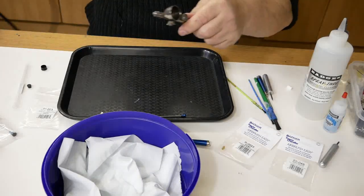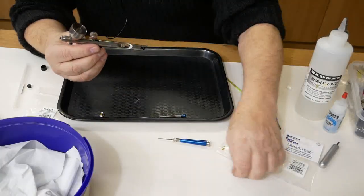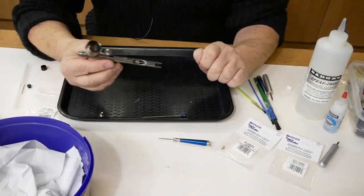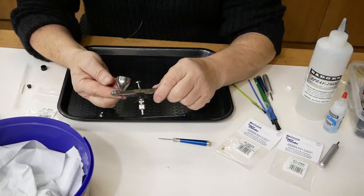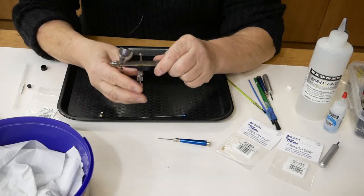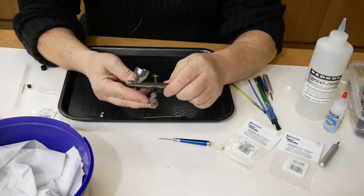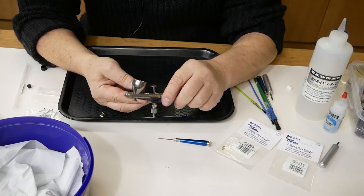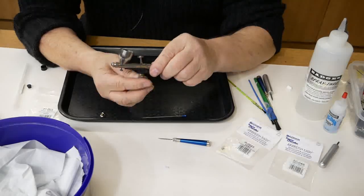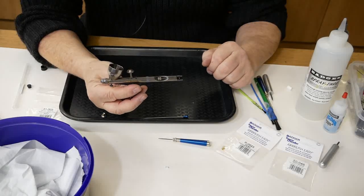So, as was suspected, the needle bearing was the issue. It has been damaged, and a new one fitted, so now I will lubricate this airbrush up. We do have videos of lubricating this airbrush. I'll leave a link in the description below to that, and I'll get this airbrush lubricated and back to the customer.